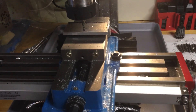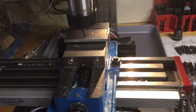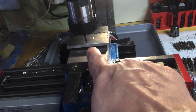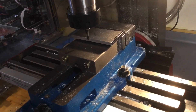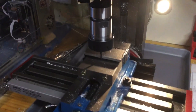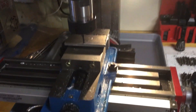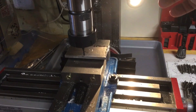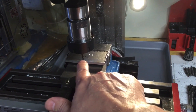The cutter is about 3.1 or 3.2mm, which is fine. I'm going to go down about 3mm - I have a Z-stop set so it can't go any lower than that, but I'm going to use the DRO and try to go down 3mm each pass. This stock is about 5mm thick. I've never used that cutter before - I have no idea if it's new or used - but let's see how it goes.